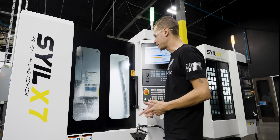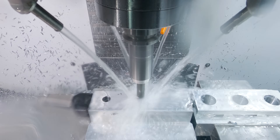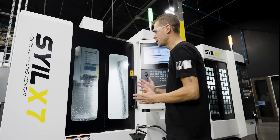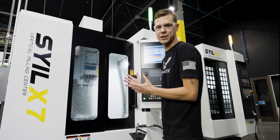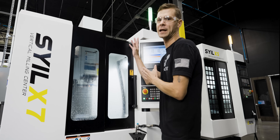The first thing going on is the drill coming in on the left-hand vise for our op 1, clearing out the majority of the material through the center of the hole on the parts. After the drill is done, you're going to see it do a double tool change — that's because we have a face mill that's considered a large tool in this machine, so we have to keep a pocket open on each side of it.